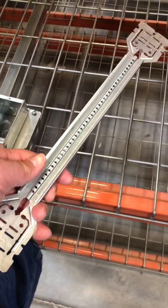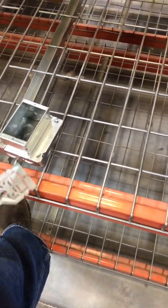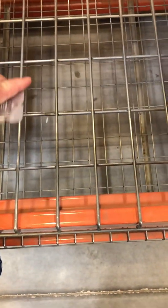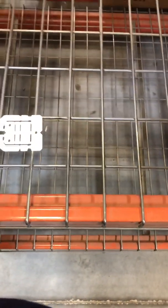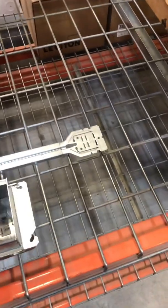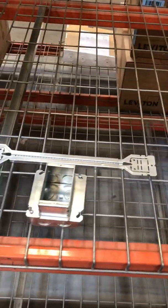These are gun brackets — they're adjustable. They've used rebar to mount to these boxes, but they really prefer these gun brackets because they are adjustable. These ends can be bent and wrapped around the rebar on either side. You might end up with the gun bracket going vertically or horizontally when the wall is stood up, just depending on where in that grid of rebar you place your boxes.